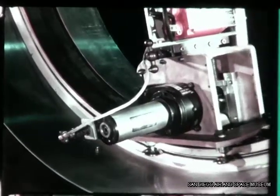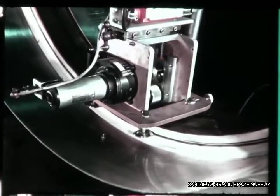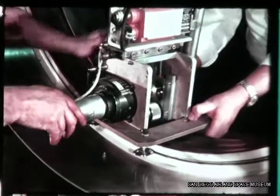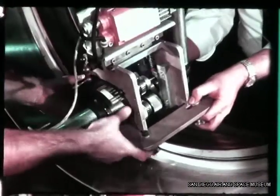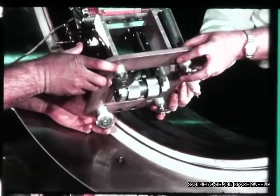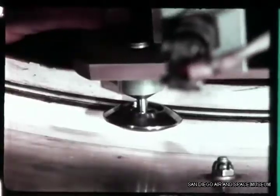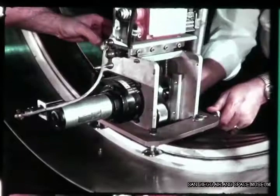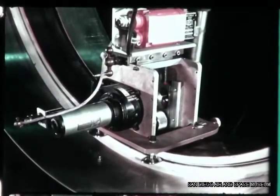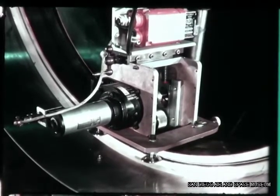The weld skate is easily attached to the track and can be quickly adjusted to engage the drive mechanism. Carriage travel speed is adjustable from 0.117 to 117 inches per minute. Speed is preset and maintained automatically by regulation of drive motor voltage. Motor speed is sensed by a tachometer generator; voltage increases when motor speed drops and decreases if motor rate rises due to changes in torque load.